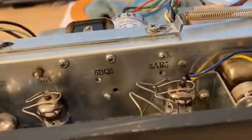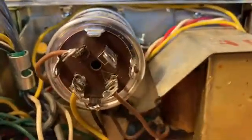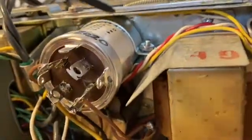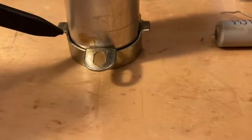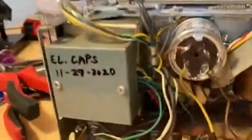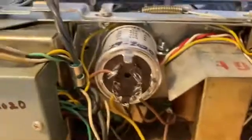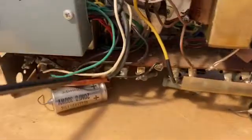It's tight in there but everything fits around it fine. The only other thing I had to do is grind off one of these — it's like a dog ear, this little tab — you'll have to grind off one of these to get it to sit down up against this top rail. But again, it's not hard to do. That's your main filtering capacitors there — along with the one down here and then this one, so those are your big ones. There are four of them, and I did the exact same thing to both sides, the left side and the right side.